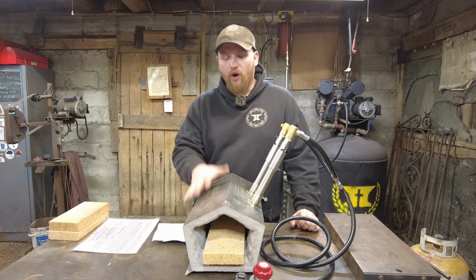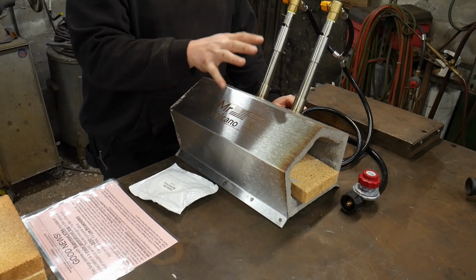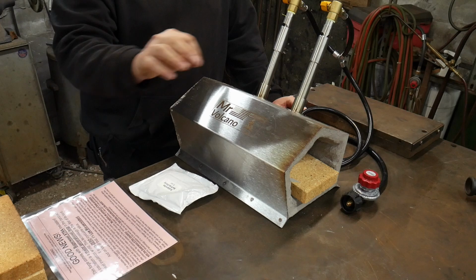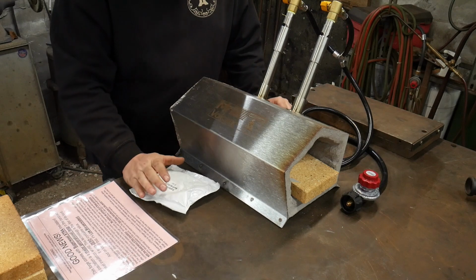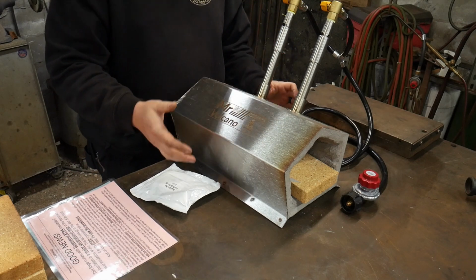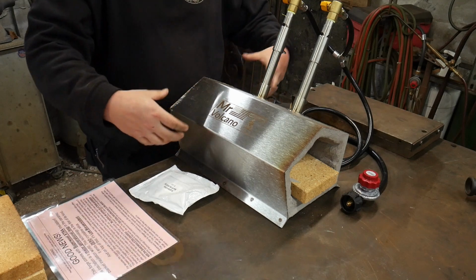This thing all put together is a fairly easy build experience, but it does require some patience, especially when it comes to putting in the refractory coating. I do recommend that you have a scale on hand so you can weigh out all your proportions, and have some little buckets to weigh everything into and mix everything up appropriately. I went over some of that in my previous video on the single burner Mr. Volcano gas forge, which I will link in the description down below.